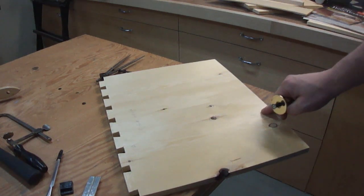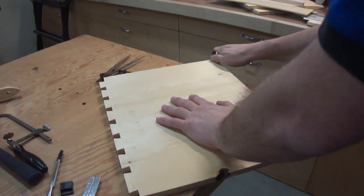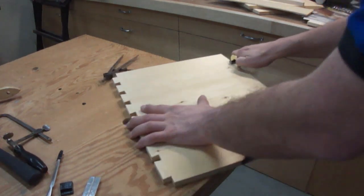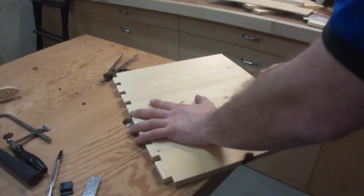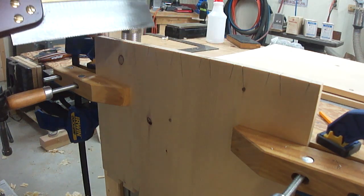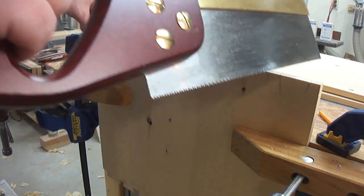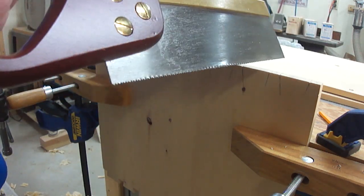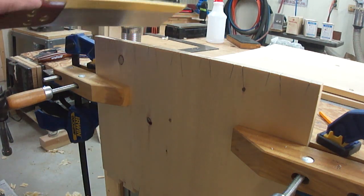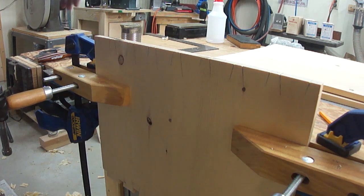Now on the back side, this is the inside of the toolbox. It's going into a corner. I'm never going to see it. So in that case, I can go ahead and cut the line all the way along. I don't have to worry about seeing it ever again. What I like to do is cut all the same angle, so that once I'm used to that angle, I can just go right along. Once I cut that angle, I'll turn and do the other side. If I try to flip back and forth the entire time, I'm more likely to make a mistake.